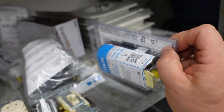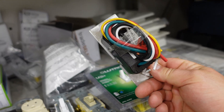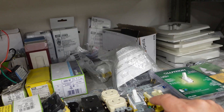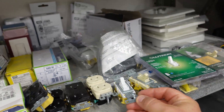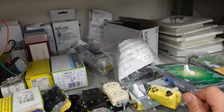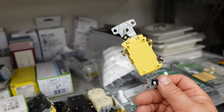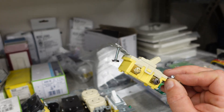This needs to be grounded. Most dimmer switches — you can see there's green — come with the ground on them. Here's a timer; it's got the ground on it. Those need to be grounded to the back of the box. Some older switches won't have the ground on the actual switch itself. This is a three-way, so that's not a ground — that's actually the common.